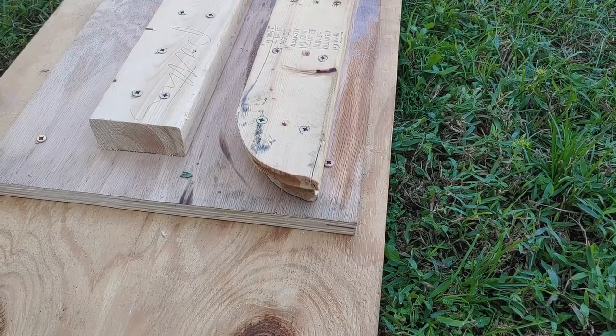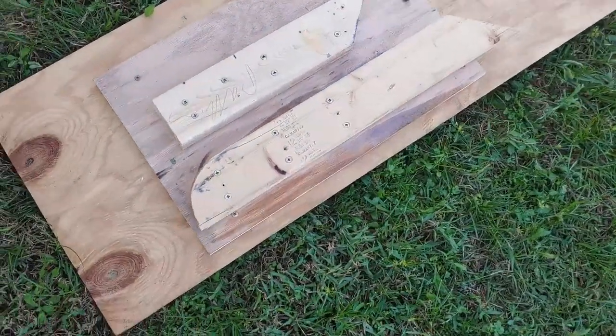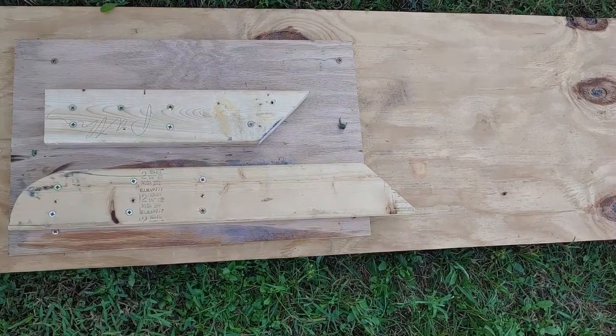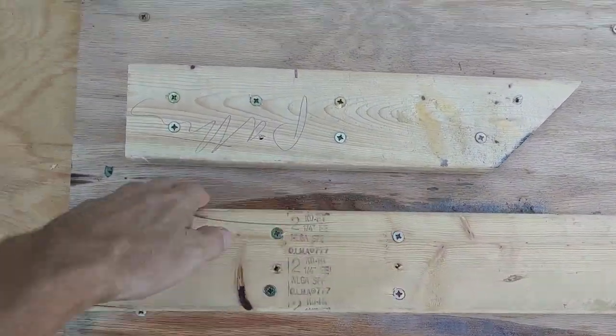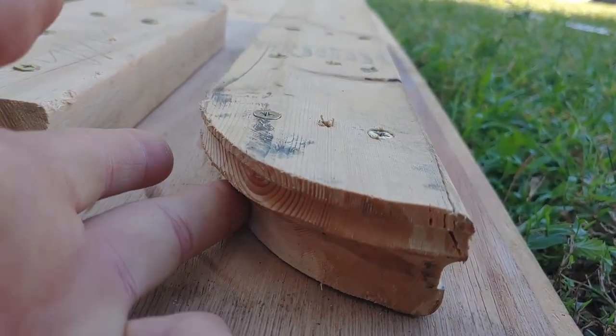So next, I had to create something to bend the pipe, and that's what this is. The pipe goes on this long piece of plywood, in between these two 2x4s, which, if you can see on the inside, I beveled out, and it's nice and rounded. The thing you've got to remember is that when you bend the steel, it tends to kink, so what we did is pack the entire thing with sand, which took a while, and then you cork both sides.